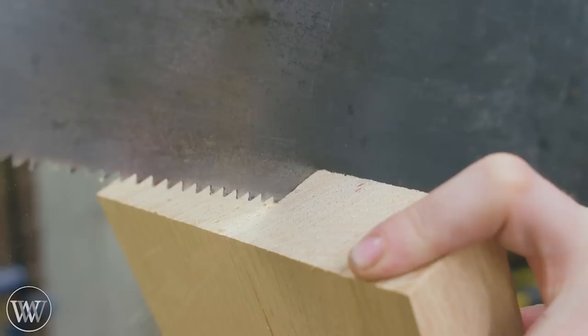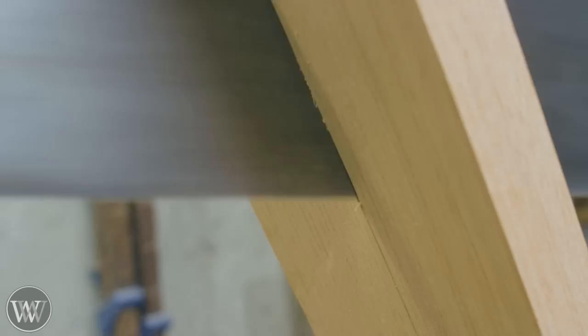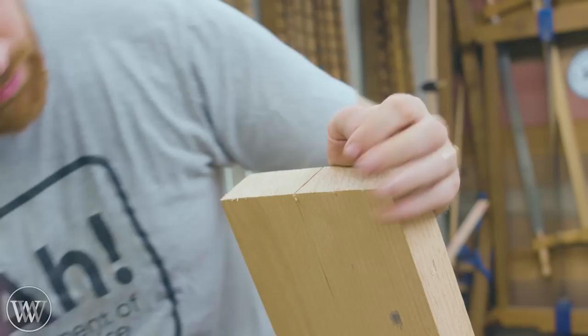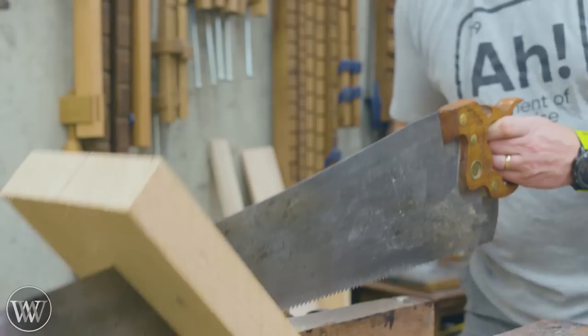I'm going to use my big-tooth handsaw. I could do this at the saw bench but I actually prefer large wood like this done vertically on the bench. It's a lot like re-sawing because it's so thick, and it actually works out really well. I'm going to treat it basically like re-sawing - cutting at a bit of an angle, rotating it around every so often, making sure I'm following the line. When I get close to the end the vice is going to want to pinch up, so I'll loosen it a little, hold it, and do the final stroke and let it fall through.